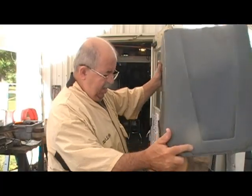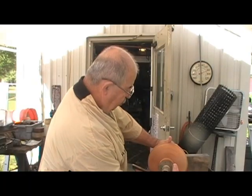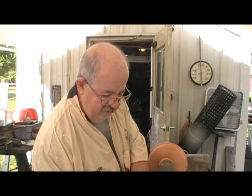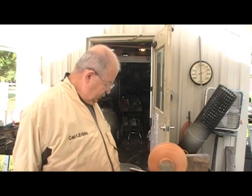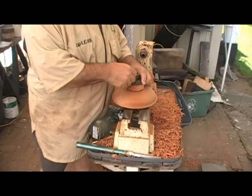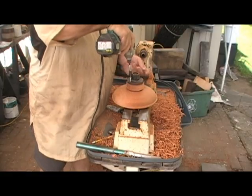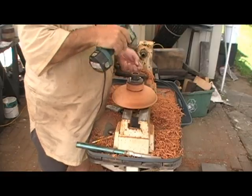As the screen says, it's another day. Take the lid off — nice indestructible cover. Today I need to flip this around: take the face plate off where it's at and put it over on the glue block. That's a pretty simple procedure, and it's going to allow me to spin out the top — the face of the bowl. The beauty of all this is that open-end bowl turning simple stuff can normally be done without a tail stock. Keep in mind we marked this to line up with the registration hole, so when we put it back together we don't have to re-register the face plate to the wood.